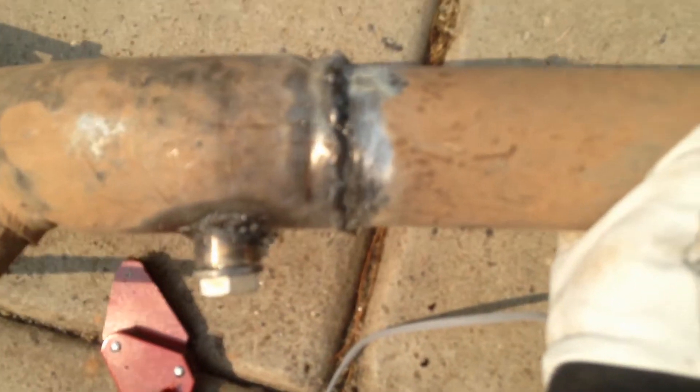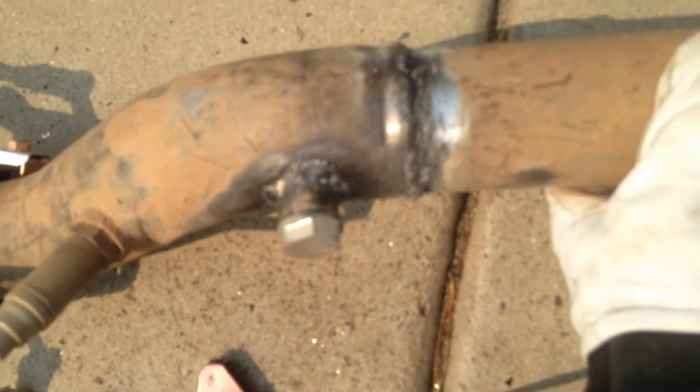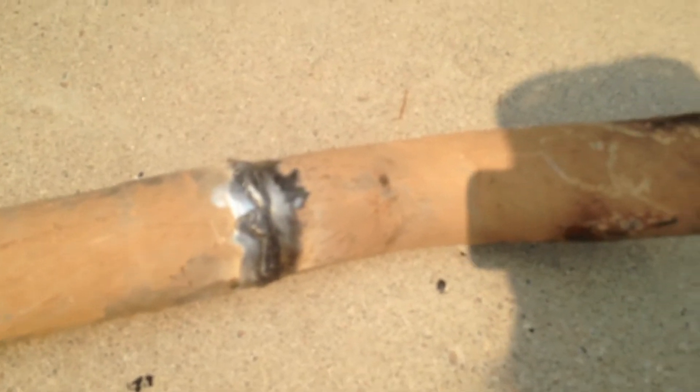It's difficult to do with my shitty hood because it darkens — at 10 o'clock in the morning daylight it darkens where I can't really see well in the shadows. I had a couple boogers — I imagine it was porosity holes. I did not prep this at all, this was just right over the mud, right over the dirt. I just wanted to see what this flux core would really do, and it did exactly what I expected — it worked. It looks like absolute crap but it's gonna function.